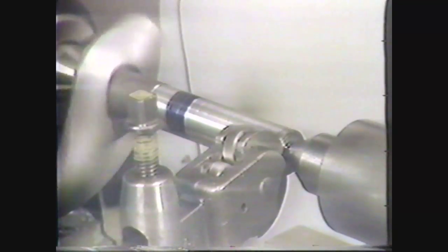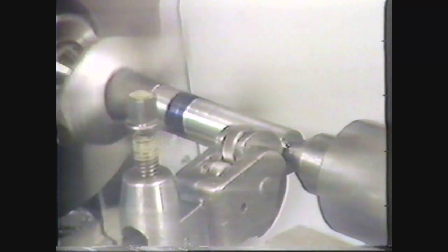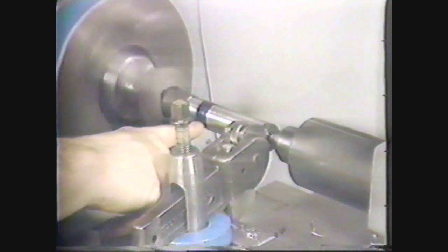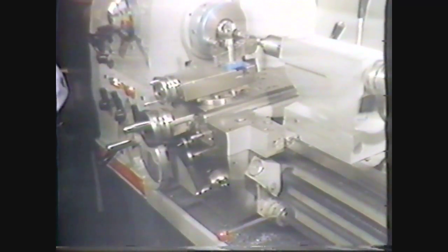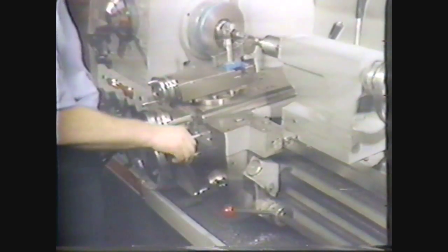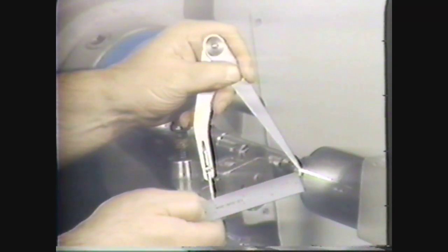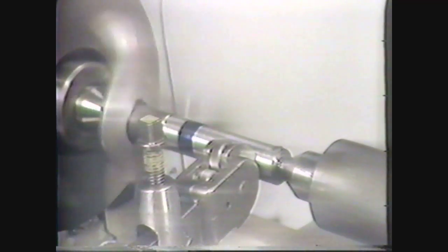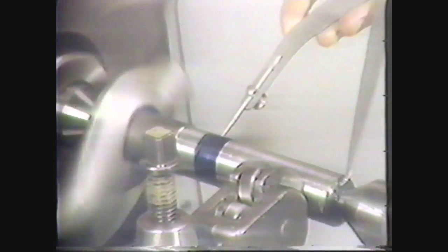In this knurling operation, you will be seeing how to knurl from the end of a workpiece to a line. The length of this knurl will be 3 inches. To properly lay out the dimension for the length of the knurl, follow these steps. Turn on the power and engage the clutch. Check the longitudinal feed to be sure it is moving toward the headstock. Here you see the calipers set to mark off 3 inches. After placing some marking blue on the workpiece at the approximate dimension, you use the calipers to mark off the exact length of the knurl. You will notice how the line shows up clearly against the marking blue.